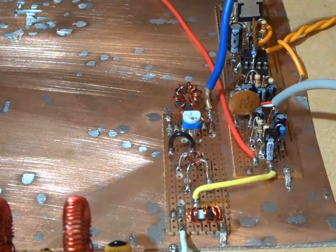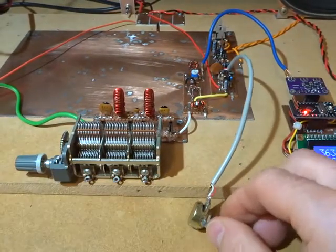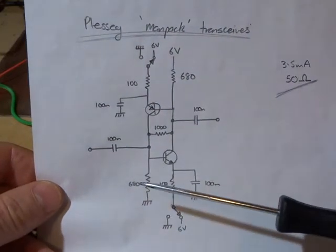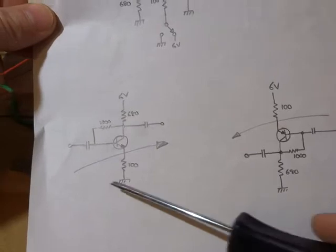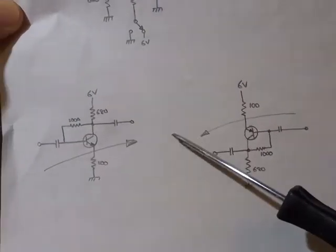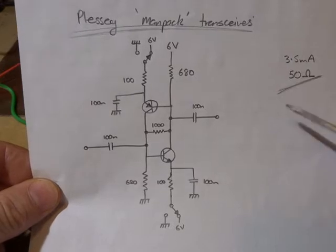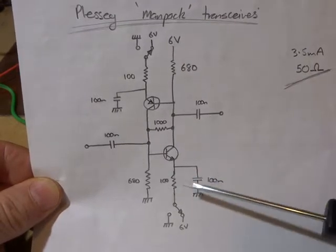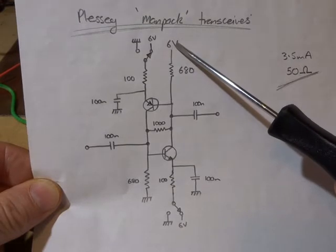Next steps will be to keep playing around with the design. As I mentioned, I was quite keen for the IF amplifiers to play around with this Plessey bidirectional amplifier setup here — depending on which way that 6 volts is selected, you get amplification in one direction or the other, so notionally this will be on receive and this will be on transmit. This is set up for 50 ohms input and output impedance, but I want to see if I can reverse engineer it and work out the design parameters, because I wouldn't mind converting it up to 13.8 volts.